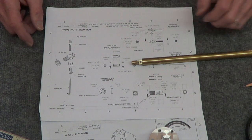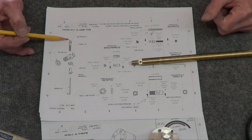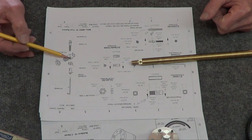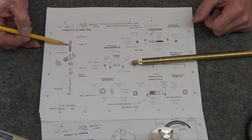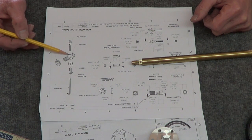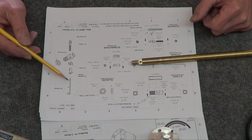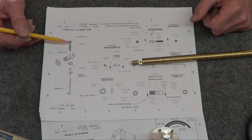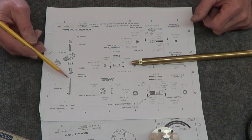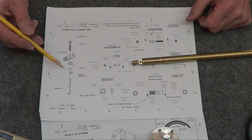And the print here, you can see what they're using for a needle valve. This little guy, I gotta make screws up in here, the jet's right here in the middle of it, and you're throttling how much fuel comes out by this guy's a plunger. So when I build this, I'm going to try to use a traditional screw type needle valve and see if I can do something that way.